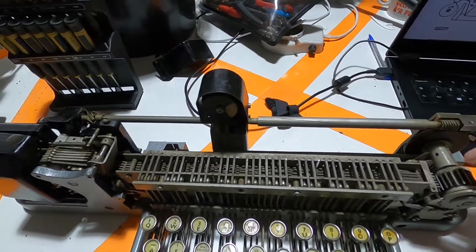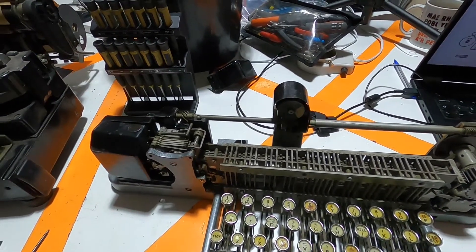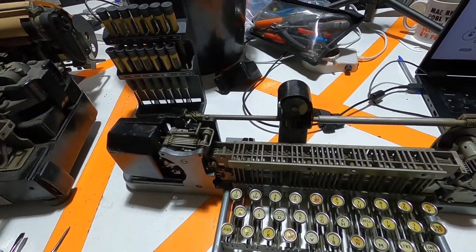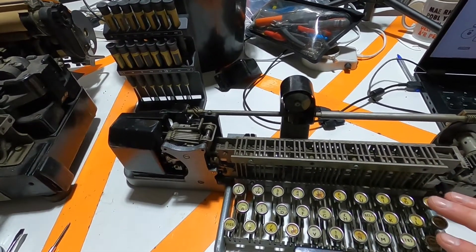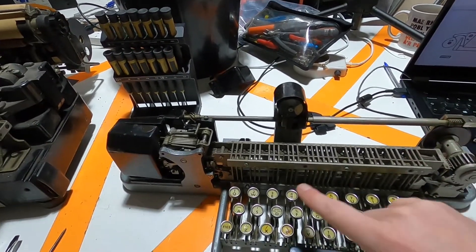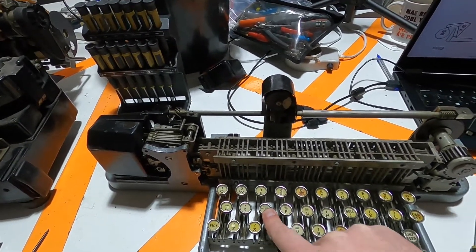This is running on Baudot, which is a five-bit code - it's kind of like ASCII. ASCII is eight-bit, so you've got any number between 0 and 255 to encode your character. In Baudot you've only got five bits, so you don't get upper and lower case, you just get uppercase. And you've got 'figs', which will switch you into a different mode - a special character that means now we're going to print numbers, or the at sign, or the 'who are you'. That's a really cool thing.